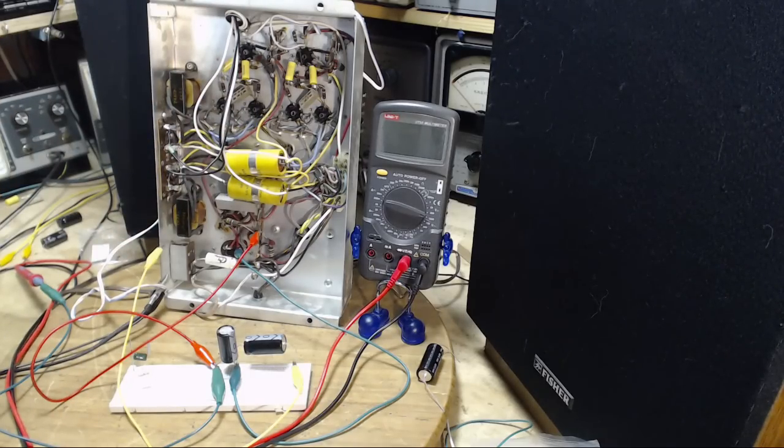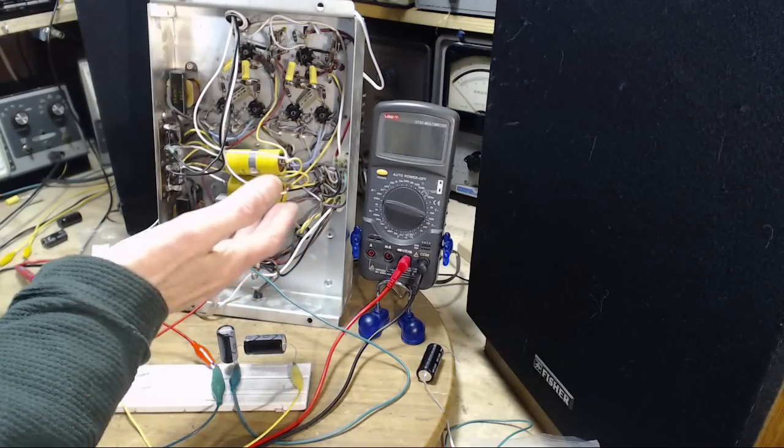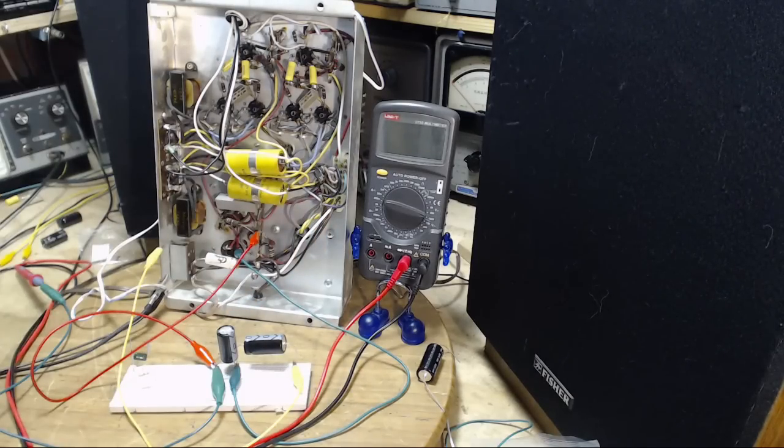My own experience with this is, in all cases of defective filter capacitors, I have never ever seen one get hot. If it's leaking significant current or doing something like that, it would get hot. They don't get hot, at least I haven't encountered one that was hot. So I can't imagine how a weak filter capacitor can interfere with additional capacitance being added. So conceivably this set is now running with more than its original capacitance, and we still hear a hum.